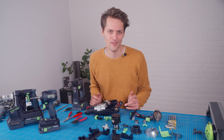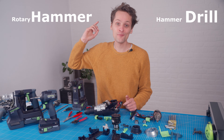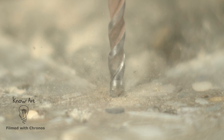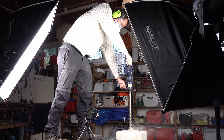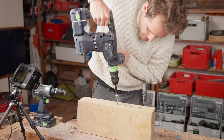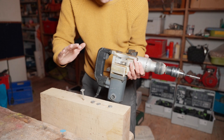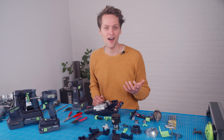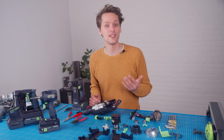In contrast to hammer drills which are drills that can hammer a little bit, rotary hammers are actually hammers that can rotate a little bit — and that's what you want for concrete and harder stones. These can drill small holes in concrete all day long and handle bigger holes for water lines. However, they generally don't have different gears, so they struggle to make a lot of torque. They often can't drive large screws, and cutting a big hole in hardwood with an auger bit doesn't work either — no gears means no power for those tasks.